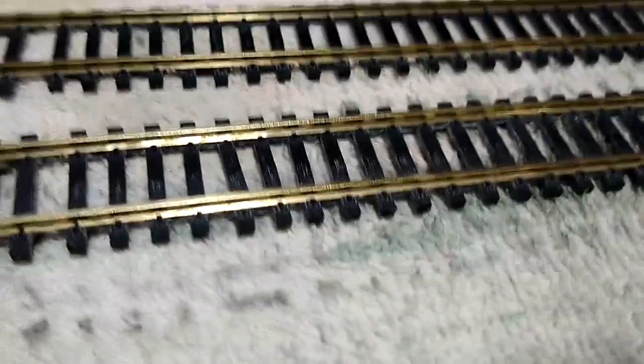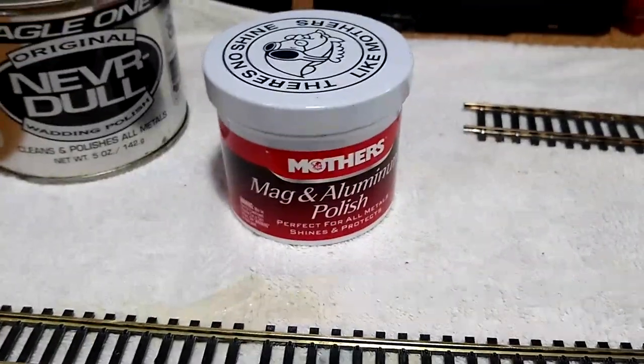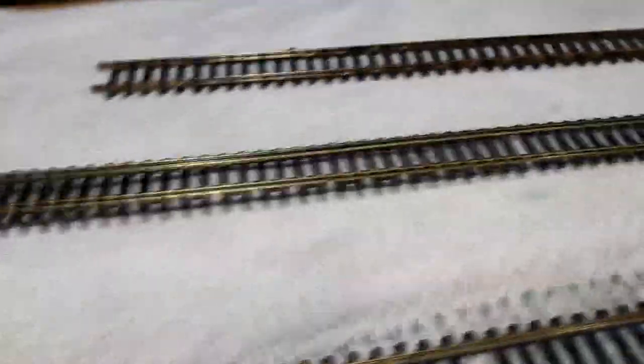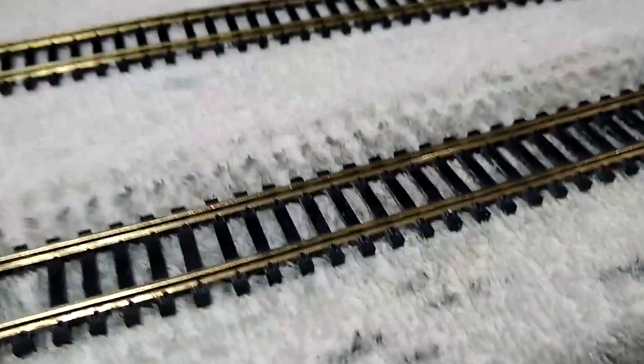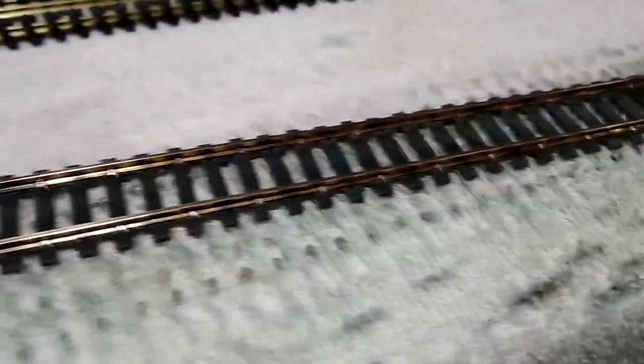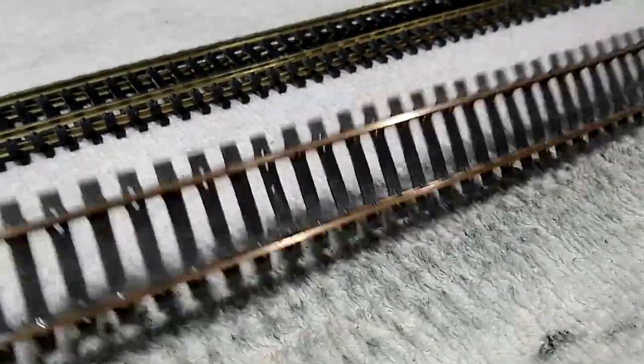The brass is so nice on here that you could take the Never Dull, or if you want to go even further use the Mothers polish. After polishing it with the toothbrush, what I did was run it in the sink — after you use Brasso you always wash it with cold water. Cold water. If you do hot water you will get discoloration. Right now it's really nice. I ran the track gauge down it — excellent. You can see a little discoloration since this has really high copper content, but it's smooth and you can bend it just the way you want and it'll stay.